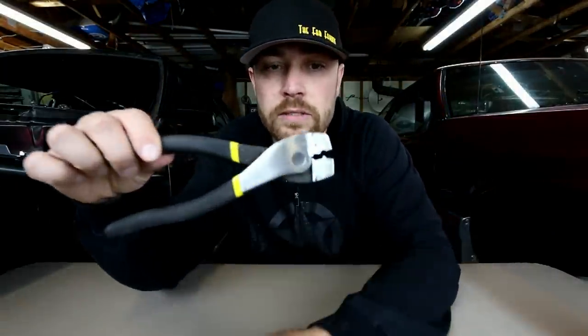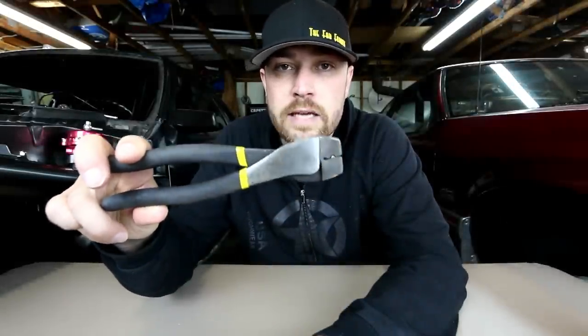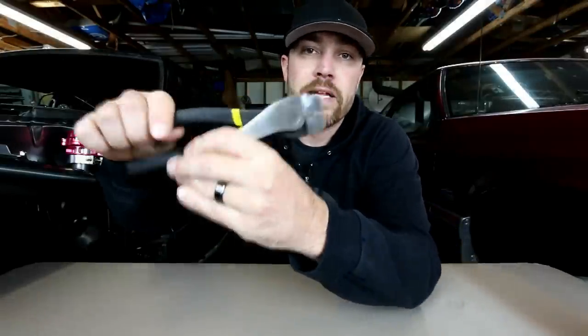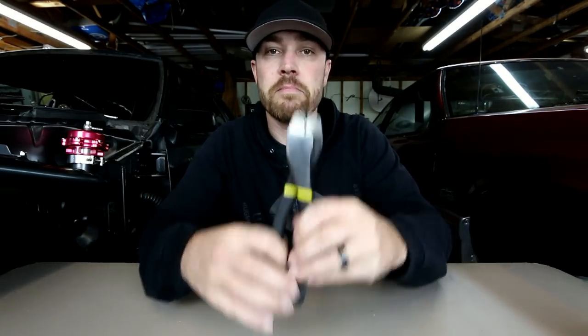So here it is — it's a bead roller. I know it doesn't look like a bead roller but it really is. I actually made this tool out of some snips and the idea came from a guy named Bart Tobner. Now if you know Bart Tobner from Mustang Racing fame, go hit him up — tell him you saw this video. He showed it to me one time when he was on the dyno and had a coupling that kept blowing off. So we used this tool to roll a bead in some aluminum tubing and ever since then I was like, I gotta have one. So I came home and made myself one.